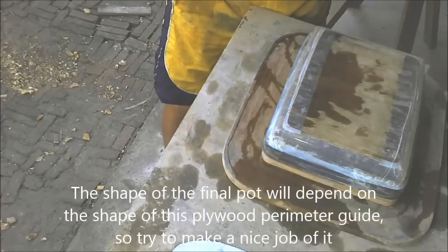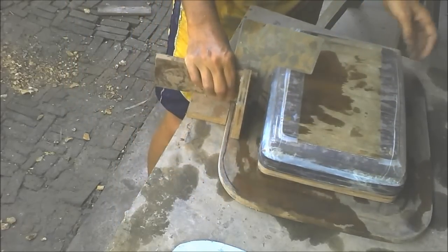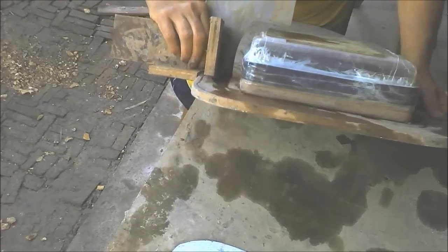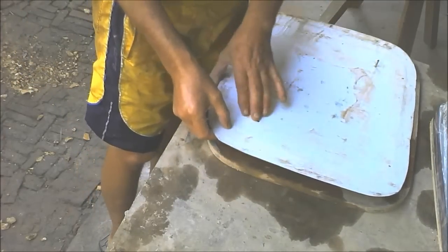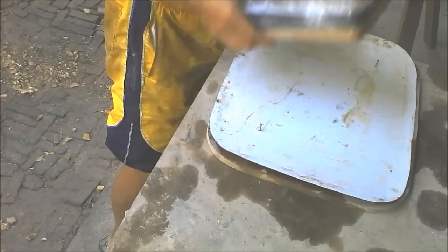What this base is going to do is when I'm doing my final shaping I'm going to use the cutter to get the shape I want, and it's going to give me my wall thickness of about half inch as I come around. But that's later on. The first step is to make what I call the inner core. Working on this plywood, I just put this cored piece in there. I didn't cut it particularly well — it doesn't really matter. Just make sure your alignment markers are lined up so you know you're in the exact same position.